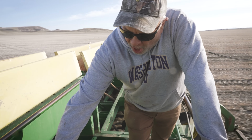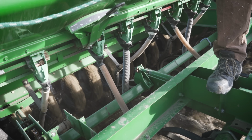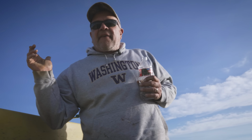The wheels in the back drive this sprocket here. The seed is metered with this lever, which slides this shaft back and forth and changes this opening right here. And that's how much seed comes out. The fertilizer is different. The opening stays the same, and there's a transmission with a gearbox, and you change the gears so that shaft changes speed. So you set it up based on a table, a chart that's printed on here for how many pounds per acre you want to put down. I think earlier today we were at E2. So the first thing was at E, and then you set it to 2, and then that turns the shaft at a specific speed. I assume it's that way because the fertilizer doesn't flow as good as the seed.